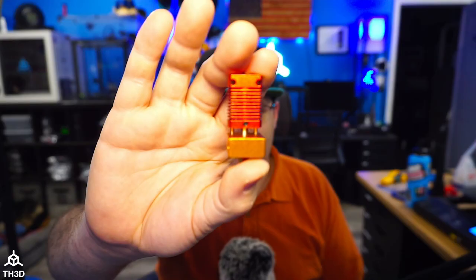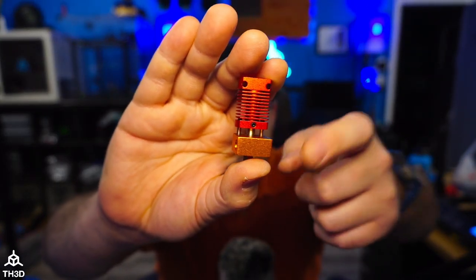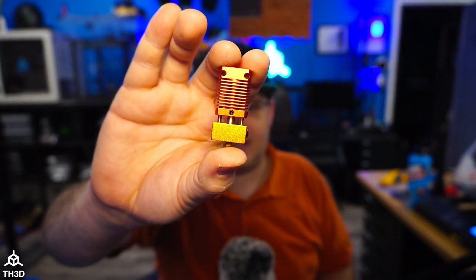On many of the hotends on 3D printers, they have what are called PTFE line hotends. In my hand here I have a Creality hotend, and you can see how wide the heatbreak is in the center, which indicates that it's a PTFE line hotend. While these hotends do make it easier to print materials because the filament doesn't stick to the heatbreak due to the PTFE tube in there, the common problem is that the fittings on top do not hold the tubing in, and also when assembled at the factory they don't always assemble it correctly.